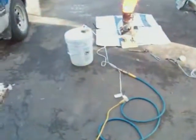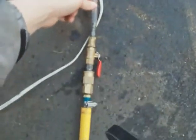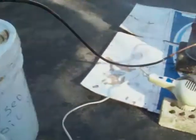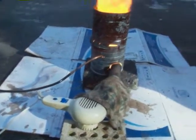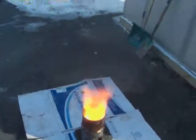Pretty much it's very simple. I have my air compressor over here, set under 20 pounds. It is running to here, which is a shutoff. Air goes in the top; out of the bottom comes the oil up through the tube, and into that metal copper tube with the P10. The reason I used a thick tube is the oil was so thick it had a hard time pushing through the thin one.